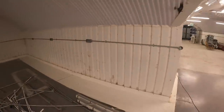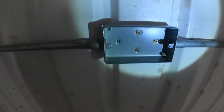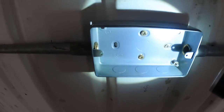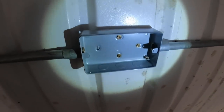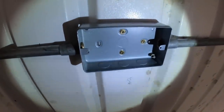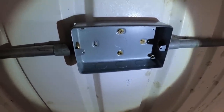Just a little update — we've got our boxes up and conduit run for the sockets. Fitting against this corrugated surface here is not very good. I was trying with these self-tapping screws but they're no good — when you get it right in, it keeps turning. So I ended up having to go to B&Q, got these little screws. We put a little pinhole through and tighten it, use that. But when I was doing it first of all the screw just kept turning, so I went and got some washers, bring it out a little bit, and it goes really nice and tight. So that's the best we could do — nice and firm, not moving, whereas before it was moving.